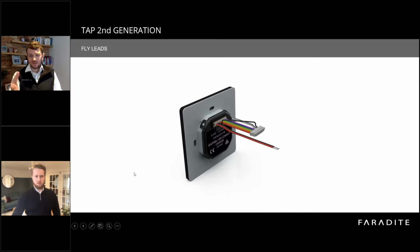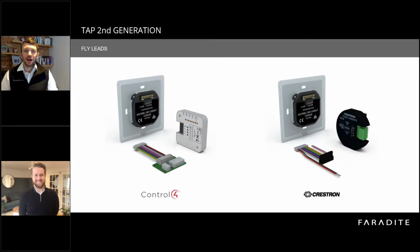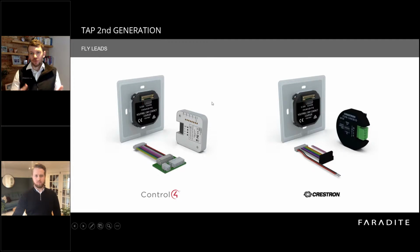So the one we see on this slide at the moment is for a Lutron system. So Lutron have a little dry contact puck. It can take up to 8 inputs. And our coupler has 6 outputs. Those of you who are astute might pick up on the fact that it has 6 outputs, and our current range of switches use 5. I think I'll leave it there. Hint.